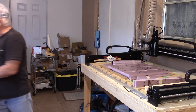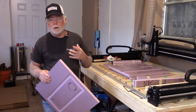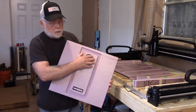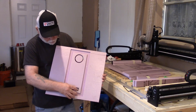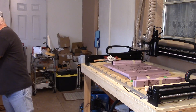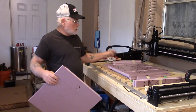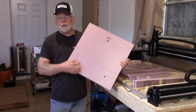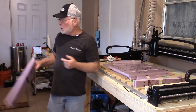One of the changes we made is that the incubator, being smaller, does not need to run the two heating elements and the two fans like the larger incubator does. So we cut that down. On the back forced air channel it's got a smaller opening for the forced air. It's also only got a single fan. The top is a little different — it's got one cutout for a single light bulb receptacle, which we include, and then two vent holes on top. We also reduced the ventilation on the side of the box down to one hole versus two.